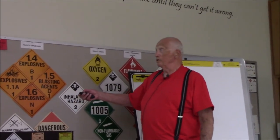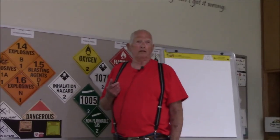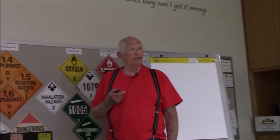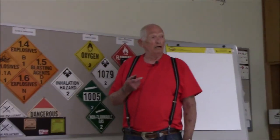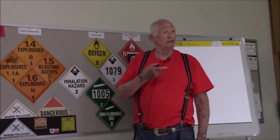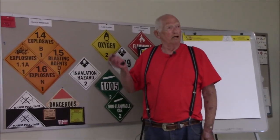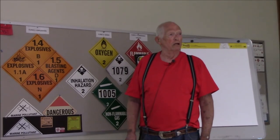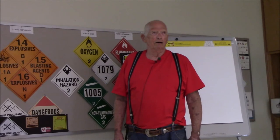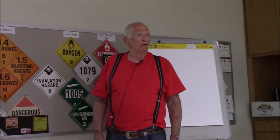When I got around to building the 80 meter antenna, I thought to myself, well, that's half the frequency. So to halve the frequency, you need four times the capacity. So I went to four 27 foot wires, and then I increased the length of the vertical section. And that was the only rationale for what I did.